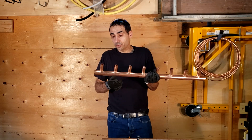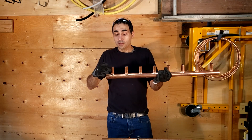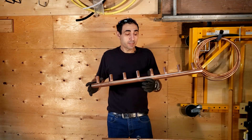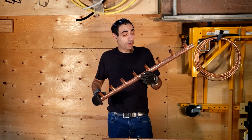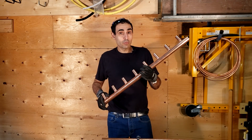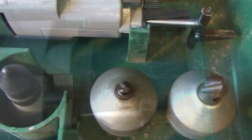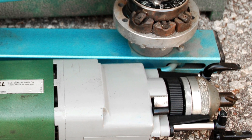One option is to purchase regular inch and a quarter piping, cut your piping as required, place a tee, solder the tee, place your outlet, place another tee, solder it, outlet — on and on. As many of you may know, this is quite labor intensive and labor equals high cost in the plumbing trade. So one quite ingenious tool manufacturer came out with the T-drill, which allows you to drill into an existing pipe and extrude a collar to act as the branch for that manifold outlet.